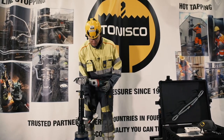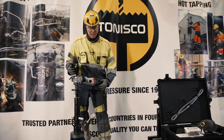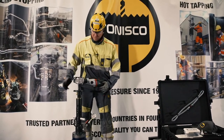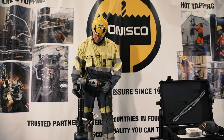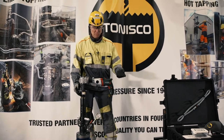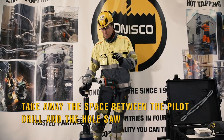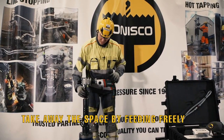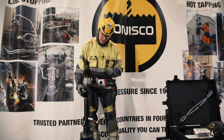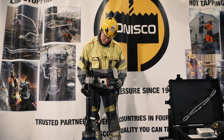You can verify the pilot drill penetration from the manometer — the pressure rises to the same pressure as in the main line. The pilot drill has now penetrated the pipe. Make a couple more turns and then we are done with the pilot drill hot tap. The small space between the hole saw and the pilot drill can be taken away just by turning the wheel. You can hear when the barb wires catch the pipe.